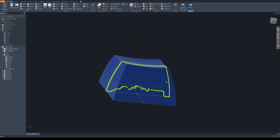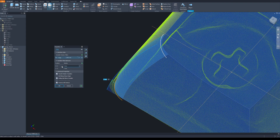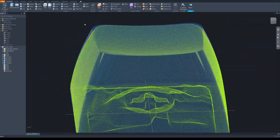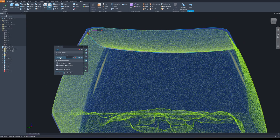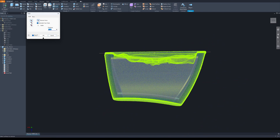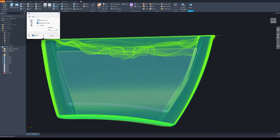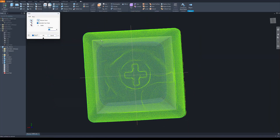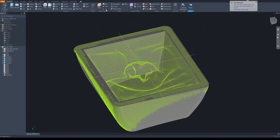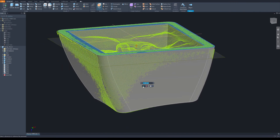I'm going to cut the point cloud with Box Crop, so now I have a cropped view. Now I make the cut in a straight line. Now we have the SA profile. Variable radius fillet — the bottom is 1.2 and the top is 2. Next I'm going to make a small fillet at the top: 0.3mm. Next I'm going to make a shell — it's about 1.4mm wall thickness. Now it's matching. I'm going to remove the bottom face, make a plane and move it down about 1.5mm.